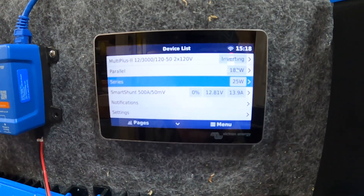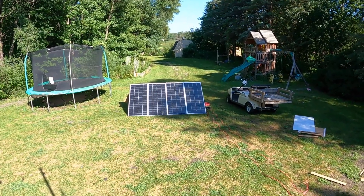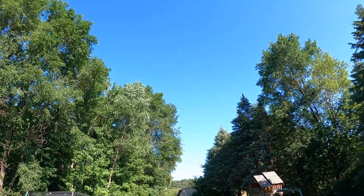We're definitely getting some differences now. You can see the two parallel panels are getting close to full sun and the series panels are still pretty well shaded. It ended up being two days we were running this test. I'm on team series and some of you are on team parallel — well, I can tell you there is a winner and a loser, and it was not necessarily what I had expected. Parallel won, but not by much.